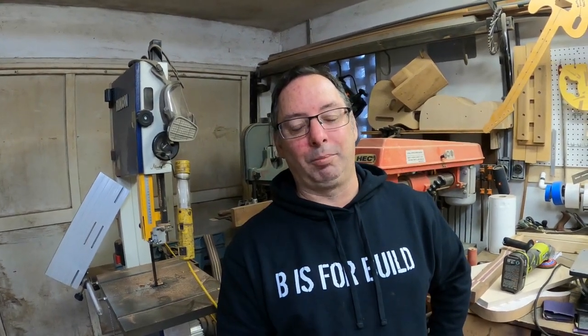Time to start soldering. We're going to use some muriatic acid as the flux. It works really well. It etches the metal really nicely and the solder lays down really well on there. This is my first go at it right here. I'd say the first 2 inches of this solder job were a little bit rough. I had to go back and clean that up later. I actually really enjoy it. It's quite fun. I like it.